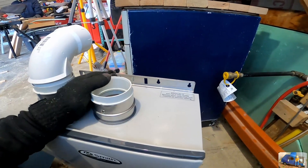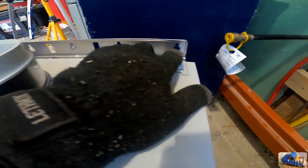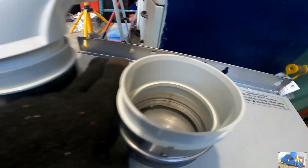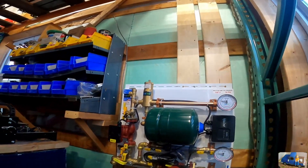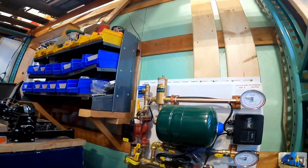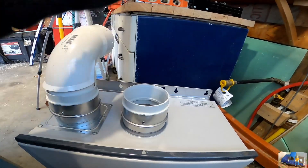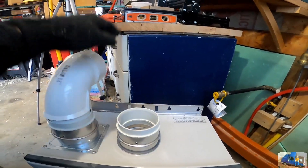This thing feels ridiculously heavy trying to hold it up there. We have some slotted holes here — we're going to try to measure and get a ballpark for where those will be for this one and the one over here, then hook the top flange up. We're kind of stuck because we have some girts up there and we need 12 inches offset between the two, so wherever this one ends the next one's going to be 12 inches up.